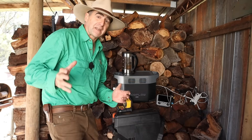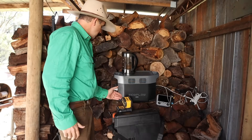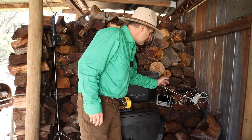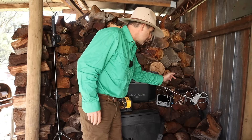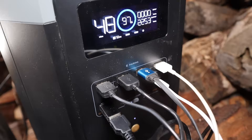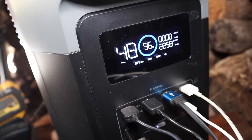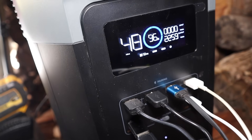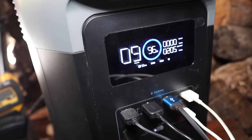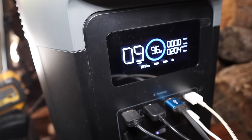Let's check out EcoFlow's off-grid capacity for normal things before we get crazy. I've plugged in a 12-volt car fridge, a battery charger, a light, and a kettle — which is not on yet. On the other side I've plugged in a remote control for a drone, a couple of camera batteries, a high-capacity torch, a mobile phone, another camera light, and a drone. They're all charging at the moment. Let's turn on the kettle and make a cup of tea. Looks like it can cope with all of the above. The kettle obviously makes an enormous difference in the draw — with the kettle going and all other devices charging, we're right up near our 2400-watt capacity. Turn the kettle off and we drop right down to about 200 watts. Kettles are a massive draw. With just the other devices running we've got about nine hours of continued battery life.